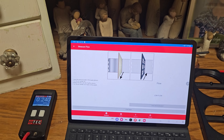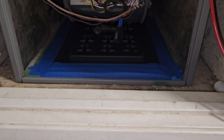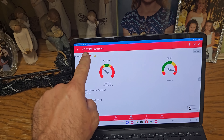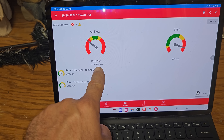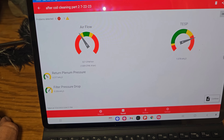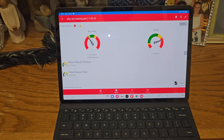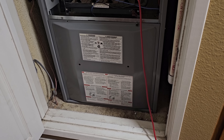It's telling me to leave the pressure probe in the supply plenum, take out the air filter, and put this guy in place of the air filter. I had to get a little creative to make sure the TrueFlow grid doesn't pop up, so I taped it down. Oh wow, that is insane — when I originally took my airflow on October 16th of '22 we had 1,135 CFMs. After cleaning my evaporator coil, we had 1,309 CFMs. That's 174 CFMs of improvement just from cleaning the evaporator coil — pretty crazy.